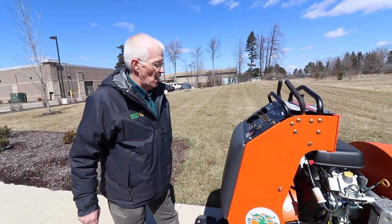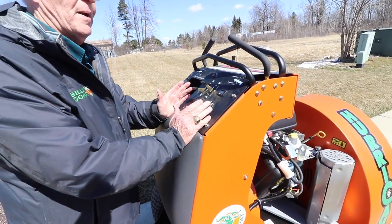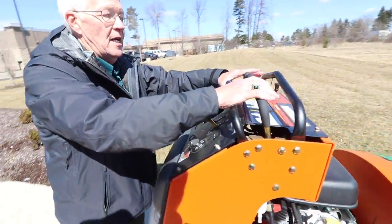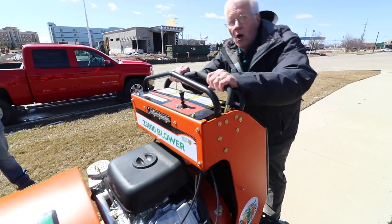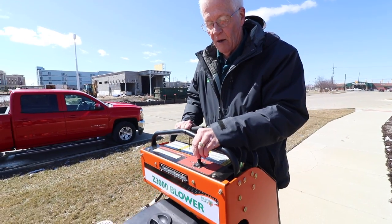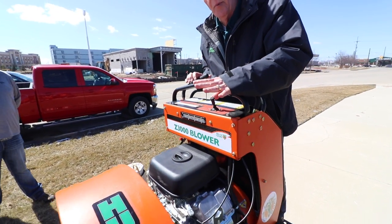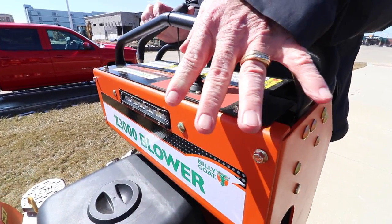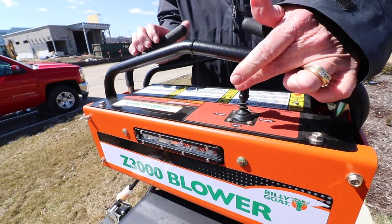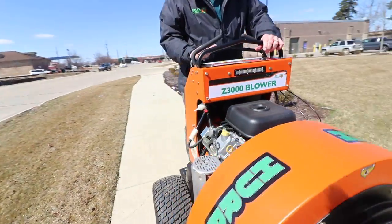Okay Brian, the control panel — your gas tank is right here, that's where you fill your 10-gallon gas tank. The rest of the control panel is very similar to any other piece of power equipment: your unlock key, your throttle, and your choke. Then your hydrostatic controls are very much like any stand-on lawnmower — forward, left, zero turn capability. The control for the panels that allow the wind to open: the front goes open when you push it to the front, close it by pulling it back. The side goes open when you push it to the left side, and to close it, you close all. The right side goes open when you push it to the right side. So if you want to select which side or to the front you blow on, that's how you do it.